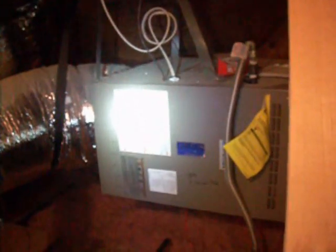Got a couple of control wires going through the cabinetry of the heater and furnace and AC unit, and there should be a grommet in there. There's not. Now, to see the type of thing that should be in there, you only have to go and look at your other furnace over the other side here. When I get here, you can see that there's a grommet there, and that protects it, stops it from being cut by the cabinet, the metal cabinet. Left as it is at the moment, it will cut through there, and that will short circuit in some time and destroy the control circuit.